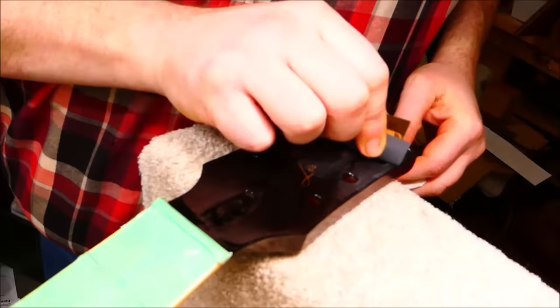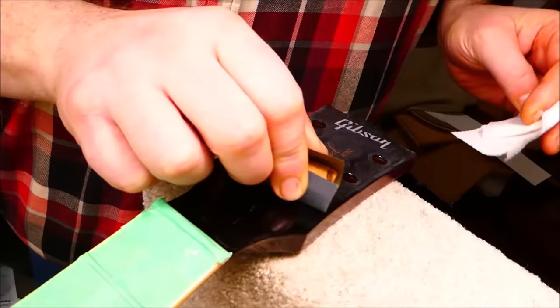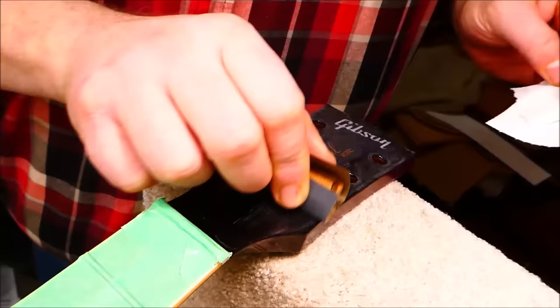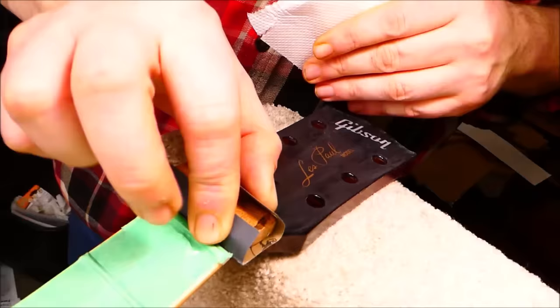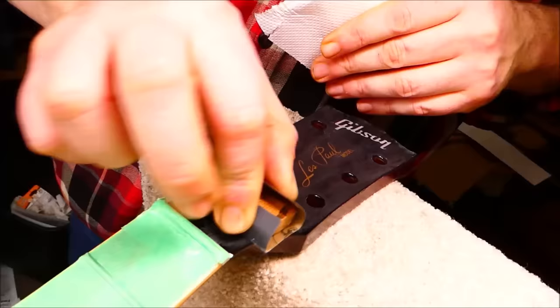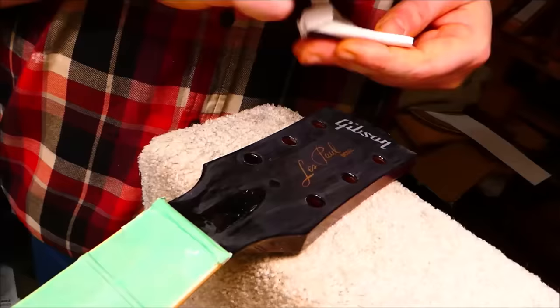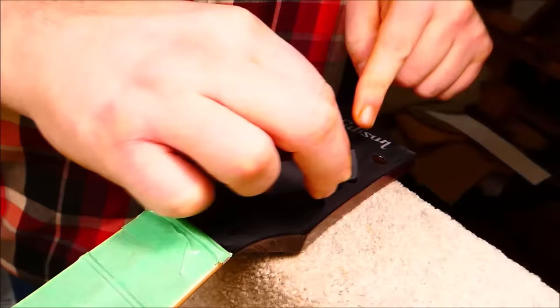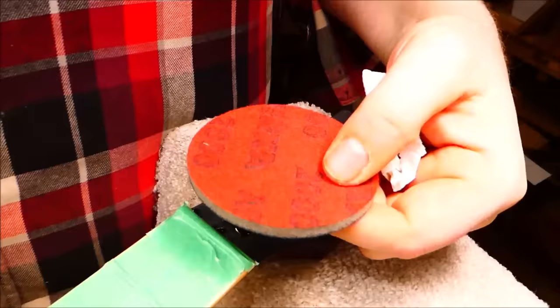It's still very soft — you can feel it when you touch it. Starting off with 1000-grit wet-or-dry paper, which I'm going to use dry. This is not a pristine brand new guitar — it's 30 years old, it was played, and it wasn't babied. It's got a lot of patina. So if there's a fine network of surface texture when I'm done, that's probably okay. The thing is to use a very light touch with virtually no downward pressure, and constantly clean off the sandpaper surface so balled-up crumbs of lacquer don't get mashed down against the surface — that can do more damage than the sandpaper itself.